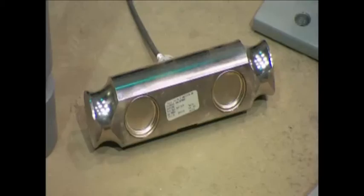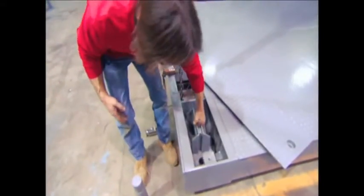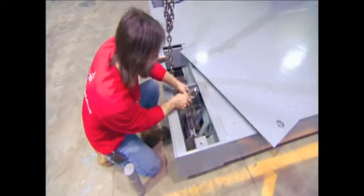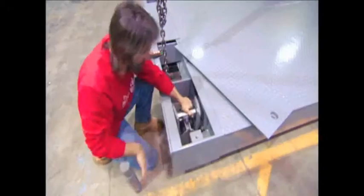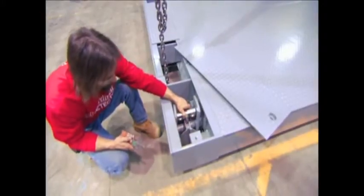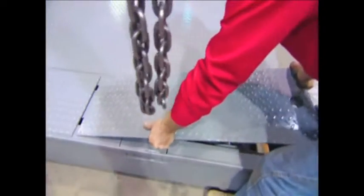Now that all the parts are ready, final assembly of the truck scale can begin. The weigh bridge, right side up now, contains 8 load cells at different locations. The first step is to install each load cell stand into its respective position. They insert a link on each side of the stand. They position the load cell at the top of the links and the bulkhead pin at the bottom. Then they close up the location with an access plate.